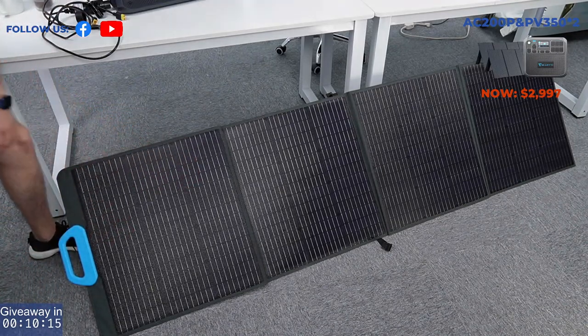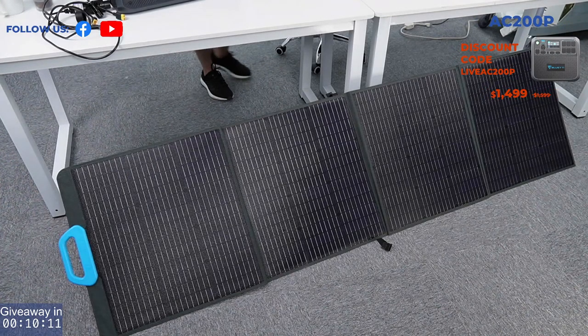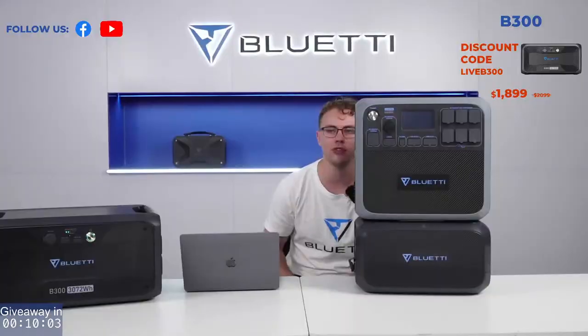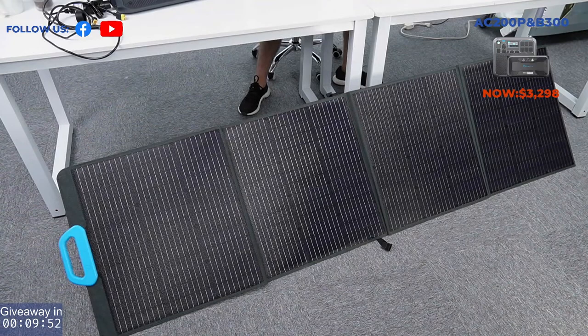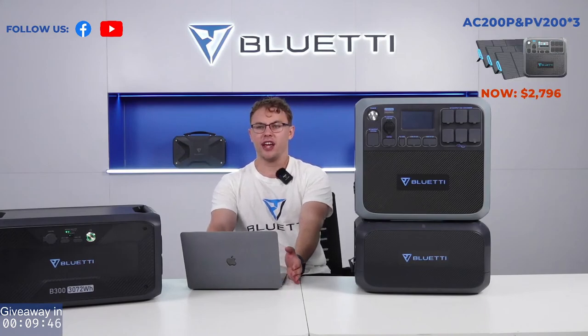All right. So current at max power IMP is 9.7 amps. But all this info is in the user manual, so don't worry about it. Open circuit voltage, the most important thing, is 26.1 volts. Short circuit current is 10.3 amps. And operating temperature is from 14 to 149 degrees Fahrenheit. The nominal temperature is 77 degrees Fahrenheit. Okay. All right, guys, cool. So this is the basic info about